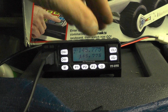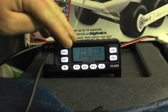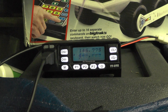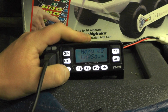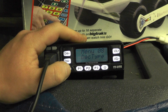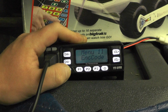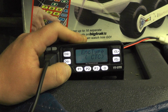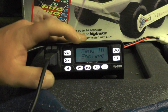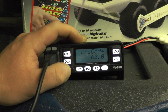Pushing the C key to get back to VFO, we're typing in 433.325. Push the Menu button — this one has got a CTCSS tone on it. It says encode type, and we're going to change it to CTCSS encode, then set encode code up to 82.5.